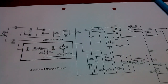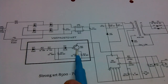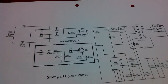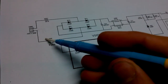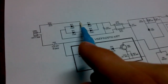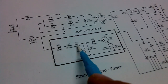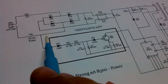Luckily I did find the schematic too, so I can test components easily. This transistor is highlighted in blue. This highlighted section is, I think, a line under-voltage protection. You can see here - the positive top of the waveform appears here and negative here. So positive goes through this diode, negative goes through this diode to here.